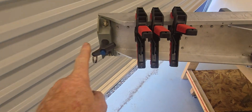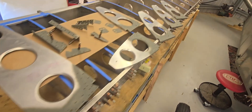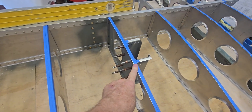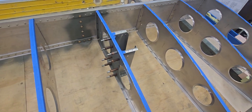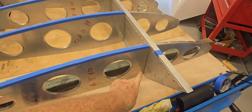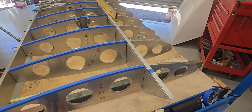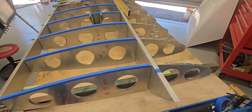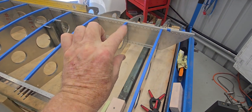The mounting blocks have been put back on here — I hadn't done these bolts through here at that stage, but they're all now completed. The reinforcing angle for the tie-down bracket is done. Still waiting on the parts from Sonics — they should be here maybe midweek — and then I can finish off the bell crank. One job I didn't mention yesterday that I still have to work out is a conduit through here from tip to root for the cables to run for the navigation lights.